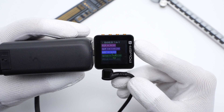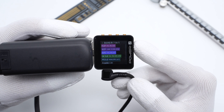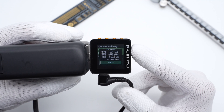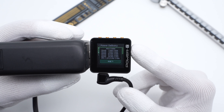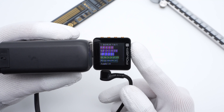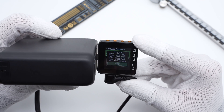The KM002C shows USB-C3 supports QC3.0, QC5, AFC, FCP, SCP, PD3.0, and PPS fast charging protocols. It has five fixed PDOs: 5V/3A, 9V/3A, 12V/3A, 15V/3A, 20V/5A, and a set of PPS. The supported protocols and PDO information of USB-C4 are the same as USB-C3.